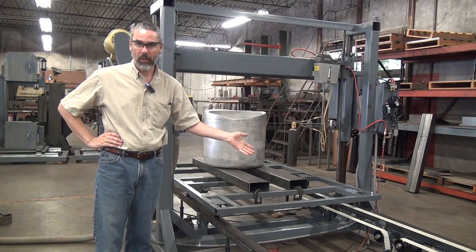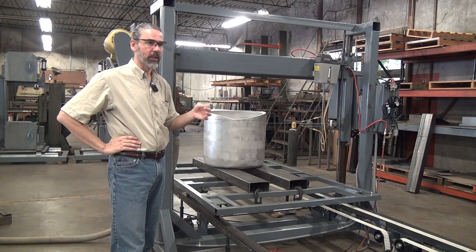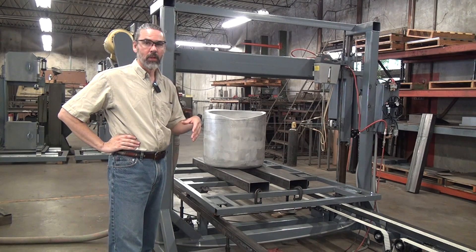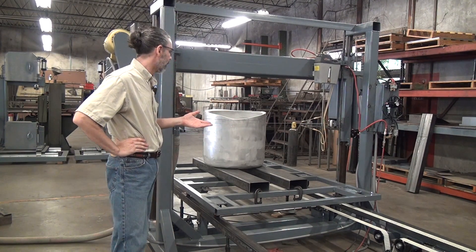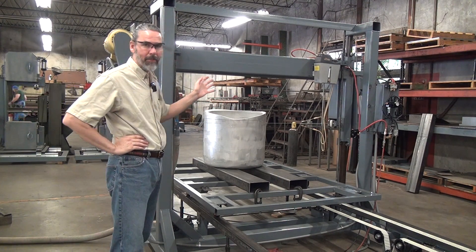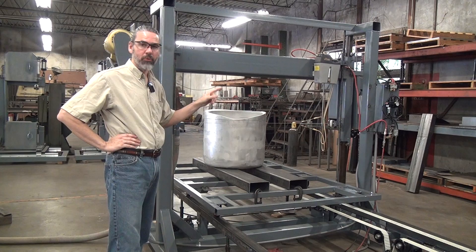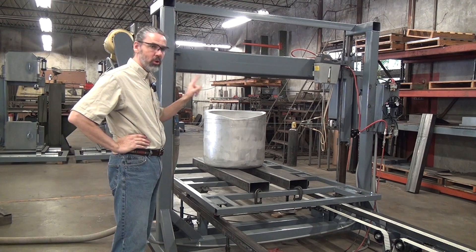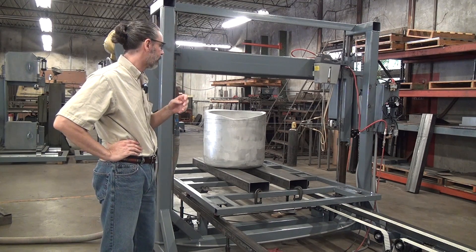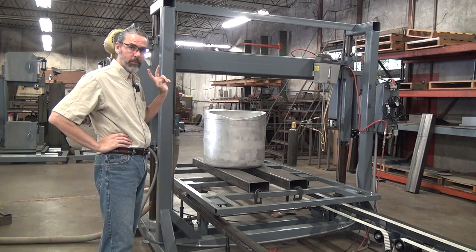So why do I think I can get away with cutting metal today? First off, it's aluminum. Aluminum, if you're a machinist, can be cut with a much higher tool speed — generally in the range of 1,000 to 3,000 surface feet per minute. This machine is set up to run at about 3,000 feet per minute. The blade I'm using today is a one inch wide by .035 thick, three tooth per inch carbide tooth blade. The first blade basically wore its teeth off running so fast, so this carbide blade should stay sharper longer and hopefully make it all the way through the cut.